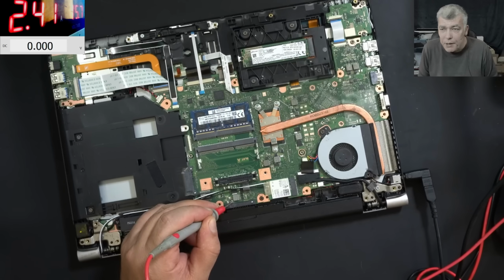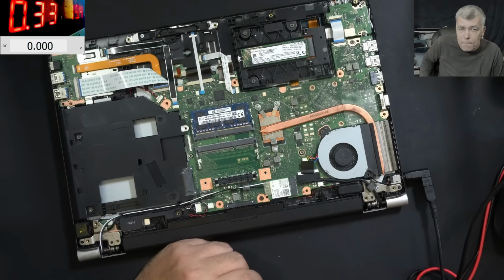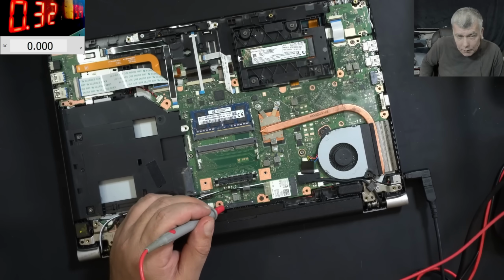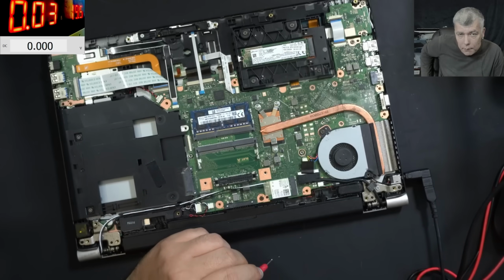Yeah, that was pre-charged current. That's the reason why it was not taking that much current. Good, and now the battery is charging with 300 milliamps. 320. Why 320? I just push some current into this battery. Okay, let's raise the current. 3 amps. Yeah, let's see now.